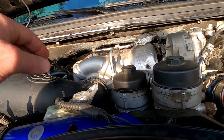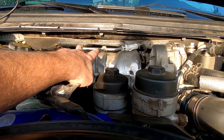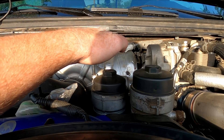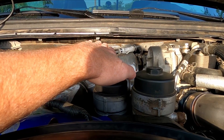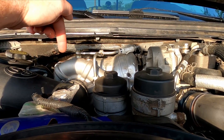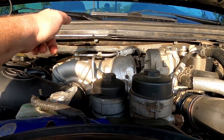So essentially, I got up here — this is your oil supply for the low side and the high side for both turbos. Checked the outlet where it comes in, checked the fittings on the high pressure and the low pressure — no leaks. What happened is, when I replaced these turbos with the cab on, instead of setting the turbo straight down I had it cocked ever so slightly. I took that metal core rubber-encased drain and scraped right down the back side of it, tearing the rubber. Now with the engine running it drains oil down the back of the drain onto the turbo pedestal, straight back down the motor on both sides.